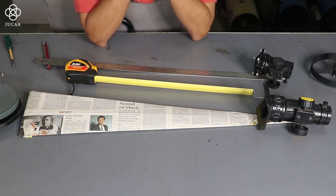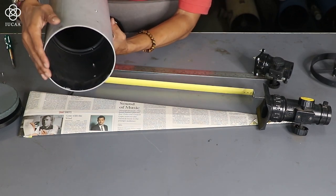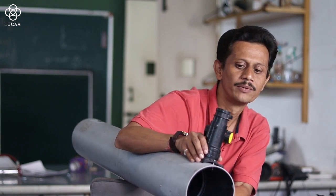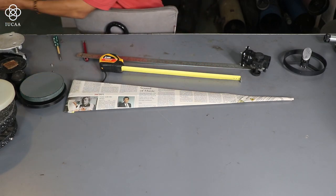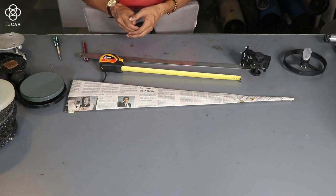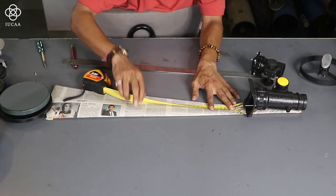Now because of the radius of the tube, when we are going to adjust this particular thing inside the tube, I have calculated the upper top, that is the focuser height. But now this distance, that is the radius of the tube, we can add. So this is my 5 inch mirror and I am using a 140 millimeter telescope tube, so it will give me 7 centimeter. When I am putting my focuser at this point, from this distance, now I will add 7 centimeter.